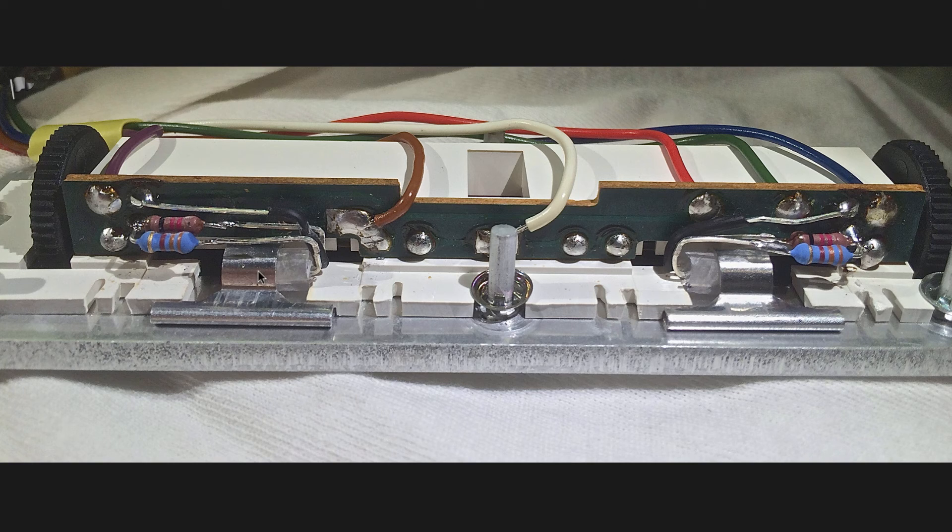I had to push the LEDs as far as I could to achieve a homogeneous illumination of the scale, because LEDs emit from the front end and are much more directional than incandescent light bulbs. In combination with roughing up the LED bulb with a Dremel tool, this yielded a fairly even illumination. I also put a little strip of tape on the inside to shield part of the scale from the light coming out of the LED front, which gave pretty much an exact copy of the illumination achieved with incandescent light bulbs.